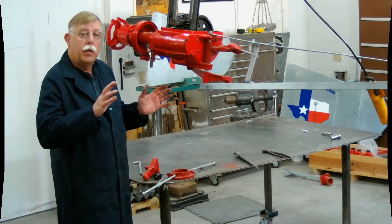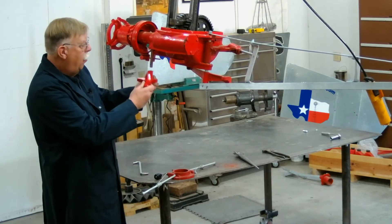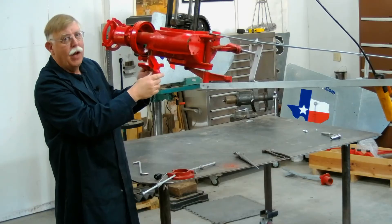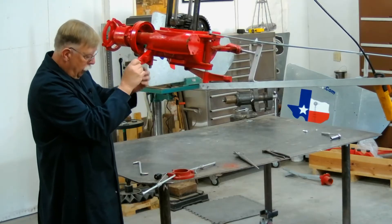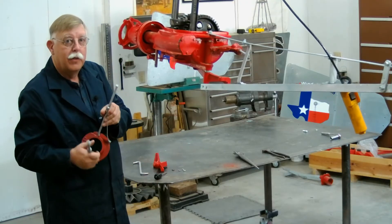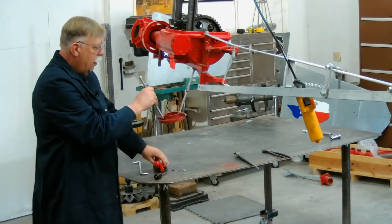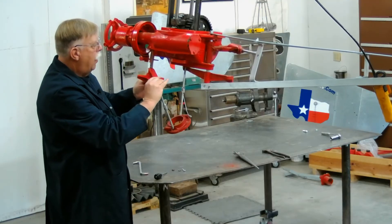I raised the motor up a little higher so you can see better. Now let's put on the brake assembly, the 786. Before we put it on, push it all the way up against the top of the motor. If there's paint on here making it a tight fit, fix it now or it'll cause problems later. All the way to the top, nice and loose — looks good. Remember the mushroom heads — roll each one in. There she goes, connected on both sides. Then it slides right up onto the pin on the motor.